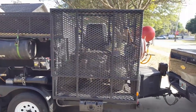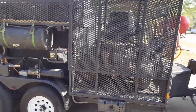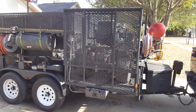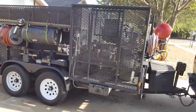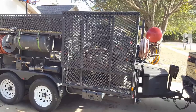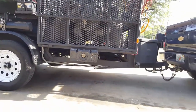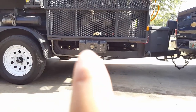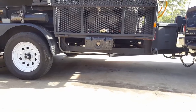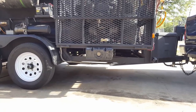This is the gate I put in the side of the trailer. When I built the trailer the first time I did put this gate in the side, but it ruined the integrity of the trailer. When I built the dump in the back it started to crack in this location. I welded it a bunch of times and it just wasn't working out, so I raised the deck up where I mount the mower so I could put a larger, thicker piece of metal across that span. Since then it hasn't given me any trouble. There's a lot of dead space down there but my six-foot A-frame ladder fits down there.